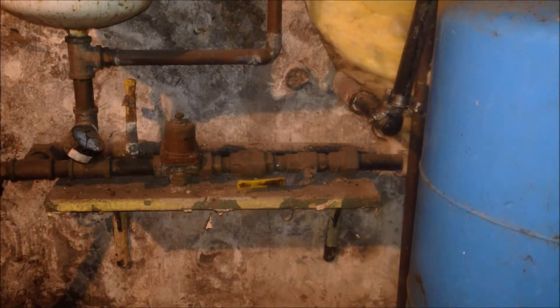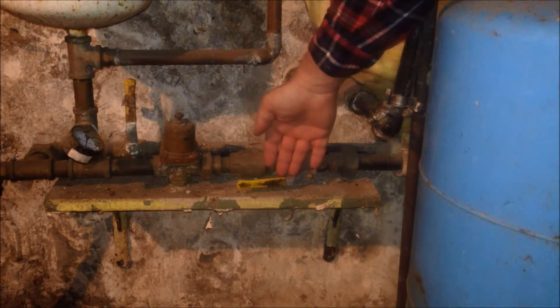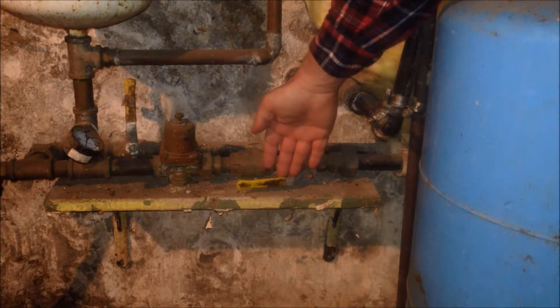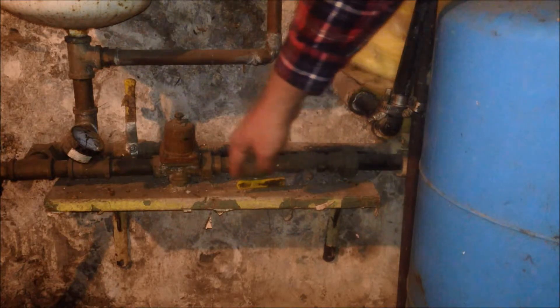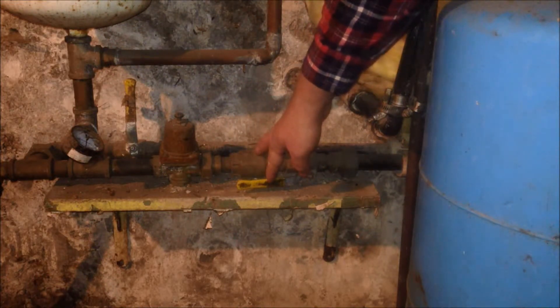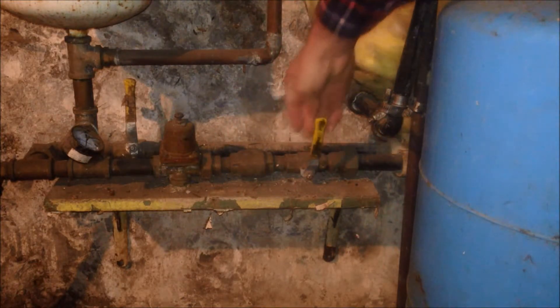In this segment I'm going to demonstrate how to turn off the water from your water source. In my case I have rural water and a ball valve that I can turn off to cease the flow of water into my house. This is the one that controls the water for my house. As you can see, the handle is parallel to the pipe — parallel means the water is turned on. What I need to do is make this handle perpendicular to the pipe.